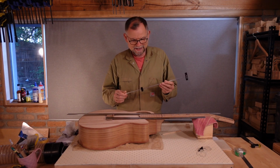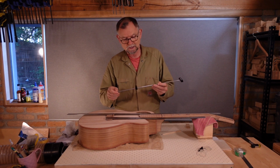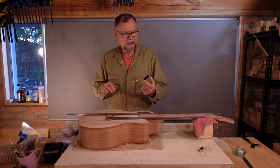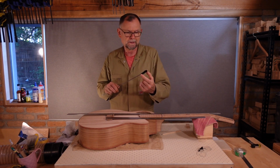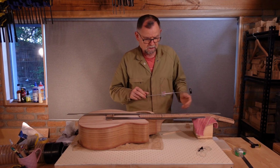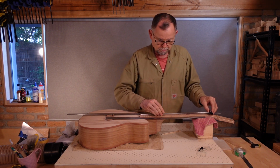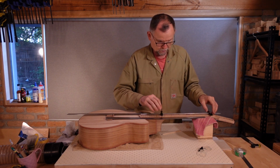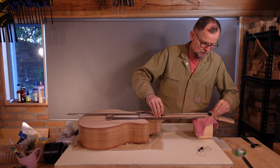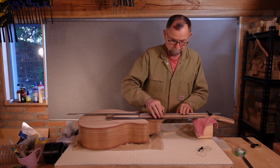This is called a saddle-matic. I've replaced the rod with a longer one so that I can make acoustic bass guitars. There's a slot in this movable piece, and at the head there are two angled spikes protruding. I've got a fret hammered into the 12th position. I filed off the barbs so that it comes in and out easily. I put the groove along the fret, loosen the screw, and then just come in so that the head is absolutely flush with the end of the fretboard. Then we can do up the screw.